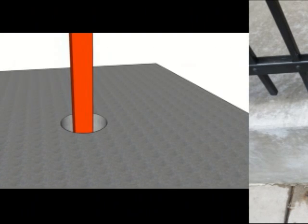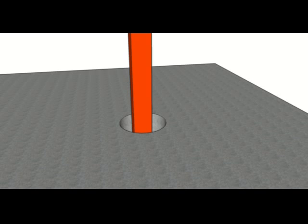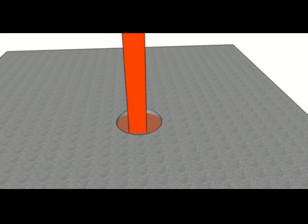I went ahead and made a drawing to give you a better idea of what's going on. They actually drill a hole into the sidewalk, ramp, or stairs, then set the metal post — whether it's a complete system or a section to be welded on later — and then fill it with a cement-based filler. These fillers are available at your local home improvement centers. I've seen self-leveling floor leveling products that might actually work — it's a dry product like cement that you mix and it self-levels.